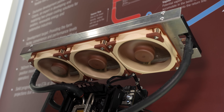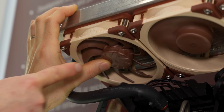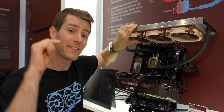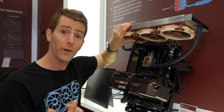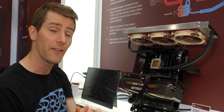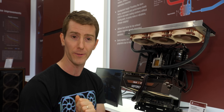I'm in the Noctua booth, so I should probably talk about the fans on the condenser. Thanks to its high torque motor and progressive bend impeller, the A12X25 Gen2 excels in high resistance applications — Noctua found three and a half degrees better temperatures at the same noise level compared to their last gen, or the same performance for a one to three decibel difference in noise. Pricing is expected to be the same as Gen1 at 34.90 euros — and who knows US dollars due to the ever-evolving tariff situation. There will be two versions: a slightly faster one and a slightly slower one that will help to counteract the undesirable harmonics of having two identical speed fans operating right next to each other or on a push-pull cooler.